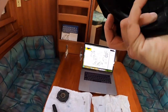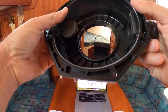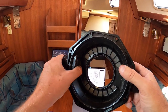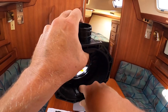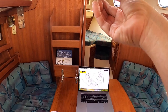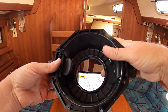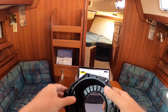Okay, this is the outlet valve — it's like this triple-action little valve here. This is the inlet. It's a flapper valve, so when there's pressure inside here it forces it closed. When the diaphragm is contracting — when the space in here is contracting — it forces things out through the outlet valve. The outlet valve is kind of like a heart valve: when there's more pressure inside, the water can flow out, but if there's pressure outside it doesn't flow back in. So it's a little bit different than the flapper valve. The flapper valve here looks good.